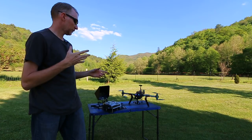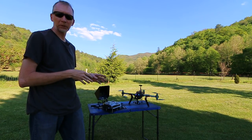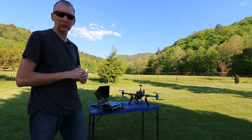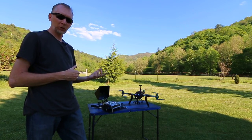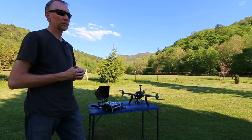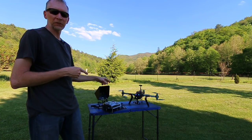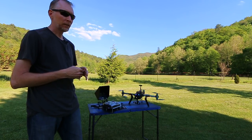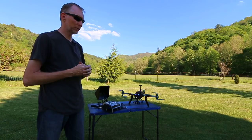But basically this is a 6-rotor helicopter, a hexacopter. The reason I upgraded from a 4-rotor to a 6-rotor is it gives you a little bit more redundancy. If there's a prop failure or a motor failure or a speed controller failure, each motor has its own electronic speed controller, and if any of those fail, it'll still fly, even if you lose 1 or 2 or maybe even 3, I'm not sure, as long as they're not on the same arm. But with a quad rotor, if you lose 1, it's pretty much going down uncontrollably.